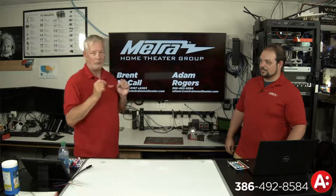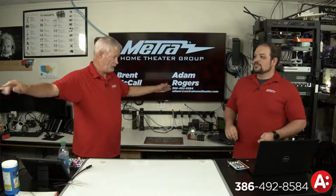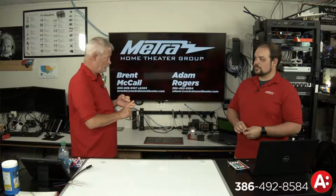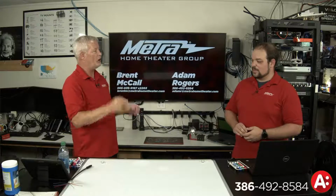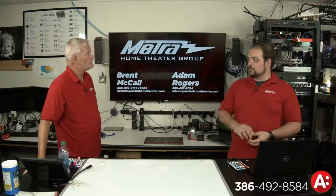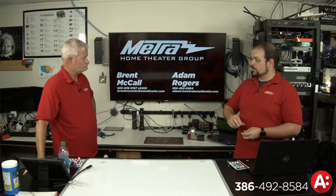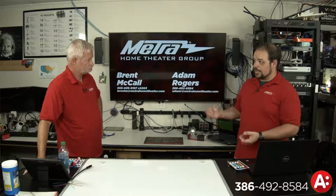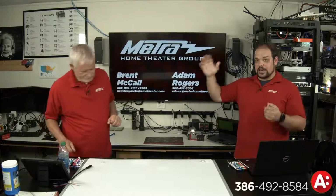Now, rise time is very important all across the HDMI interface because that covers EDID, I2C. That covers the TMDS. That also handles CEC. Everything is based on a clock, and there are several clocks. We talked about that the episode before last, when we were talking about EDID, and we drew another, basically the same eye pattern. You just have to make sure it gets there so that you get that eye pattern.